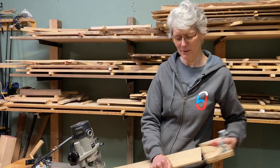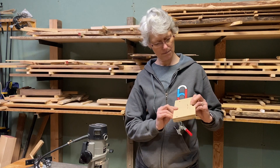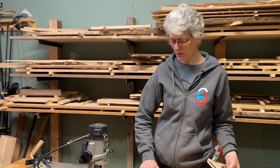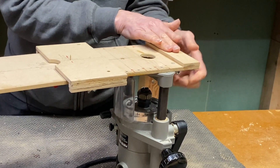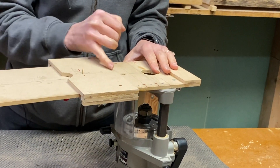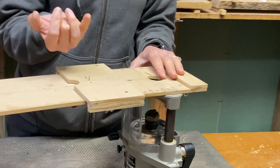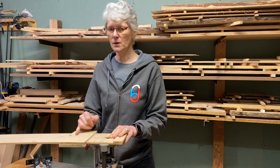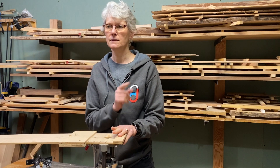You could take the bracket and put it on backwards, which would put your pin about two and a half inches farther away from the center — you'd have to figure out exactly where that is. If you're cutting a hole, measure from the far side of the router bit closest to the front edge to the center of the pin and that'll be your offset. You can also put different offset pins in different places — if you wanted one for your cornhole board and still wanted the brad point, put those in different places and use the bottom to measure from center of your pin to the outside of the hole you're cutting.